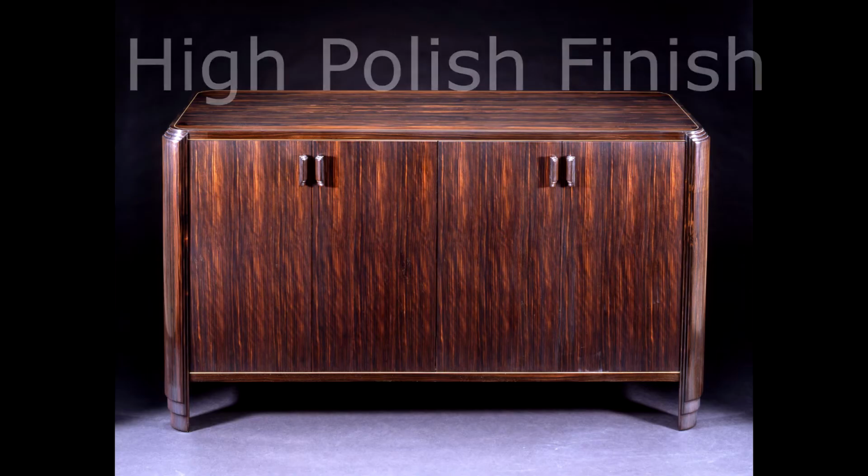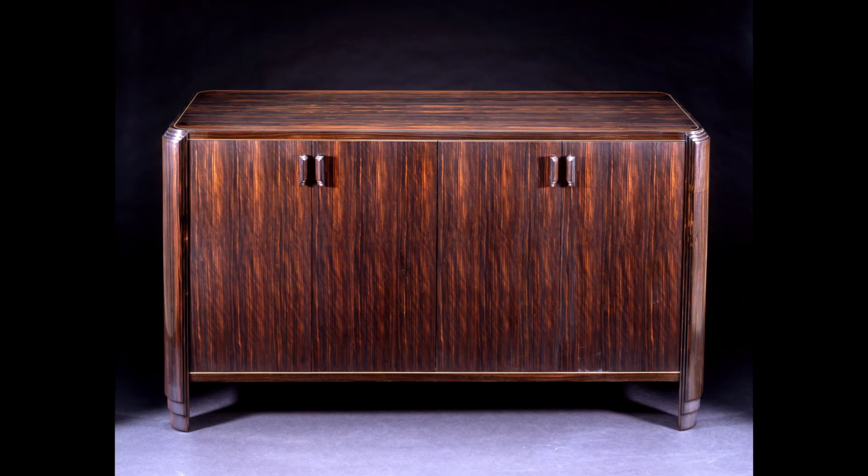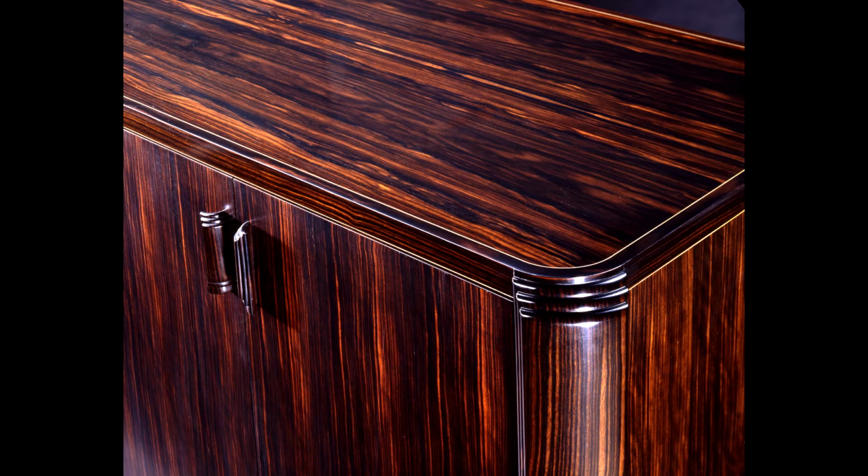5. A high polish finish. Any subtle movement at the veneer joint can show up as a faint crack line in the finish for sure. You want as rigid of a glue as you can under a fancy finish. A PVA glue will not guarantee this.